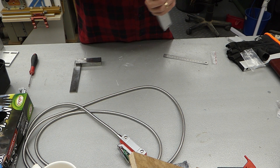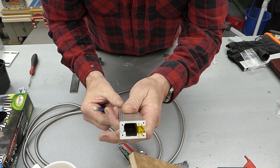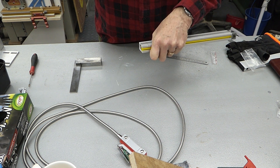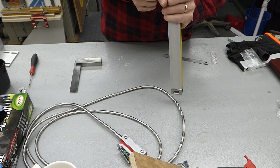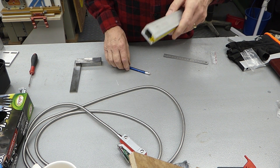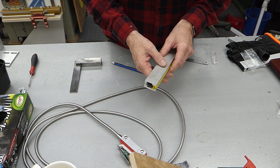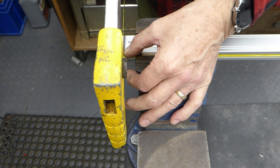Now that's going to end up cutting through the glass scale in there, but I'm not too worried because I believe if you gently cut with a hacksaw around there it will just snap off. We'll put a bit more glue in there, snap it off, and put the end back. I'm going to cut this with a hacksaw and then file it nice and clean.